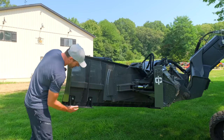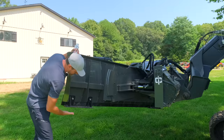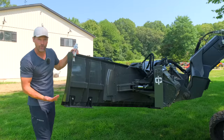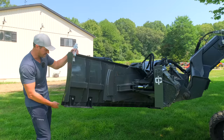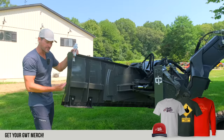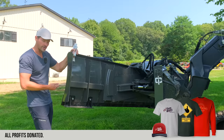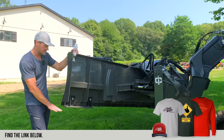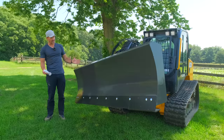You're going to have two skid runners — a matching pair, the same thing on the other side as well — big flat shoes here to support a lot of weight and help the blade not dig in if you don't want it to. The way they're set right now is flush, even with the bottom of the blade. As that blade wears, you can adjust the skid runners up using these slots to stay consistent. Or if you want to get this edge above the ground, you have another inch of play where you can lower those skid runners down so your cutting edge is going to be above grade about an inch or so.